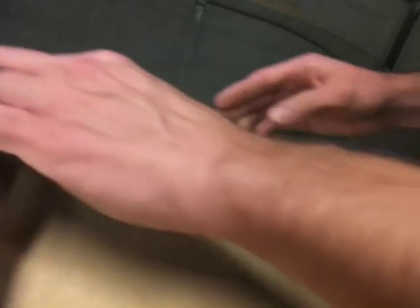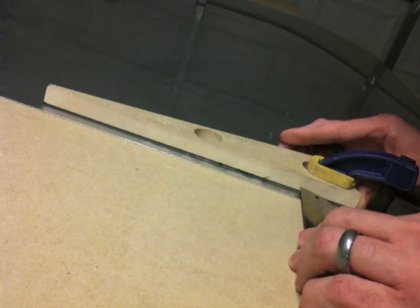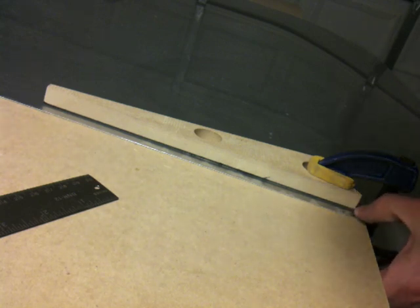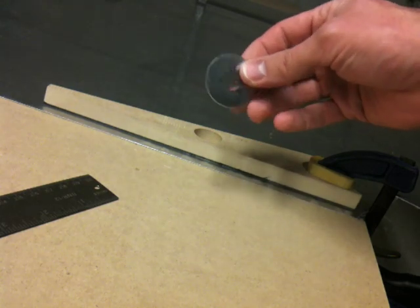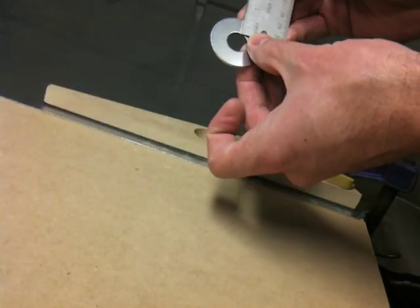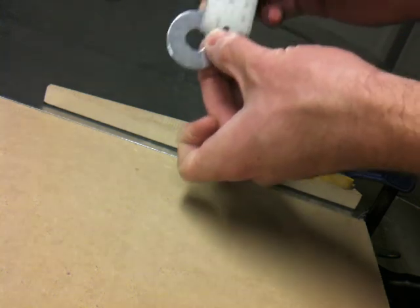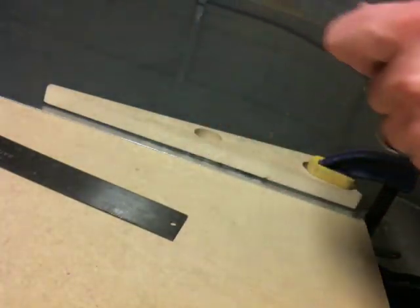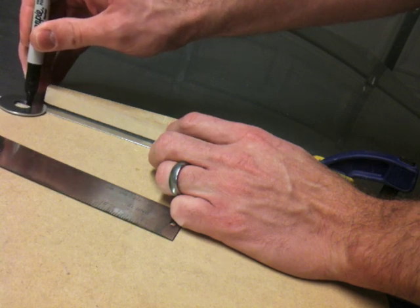I'm clamping down on the edge and measuring out 15/32" — that's what the plans call for for this particular rib. I get my edge about 15/32" away and snap that into place. For laying out the rest of it, I'm using this washer — a trick I read about online from many other builders. The washer's outside reading is just under half an inch, actually about 7/16", so when I put my pin on the edge it gives me just about half an inch — 15/32". I take the washer to the edge and trace all around my part.